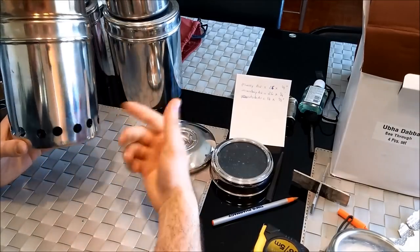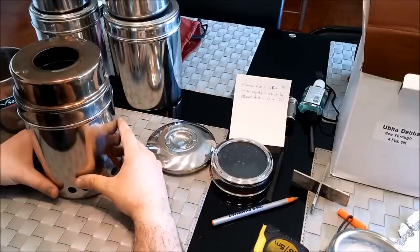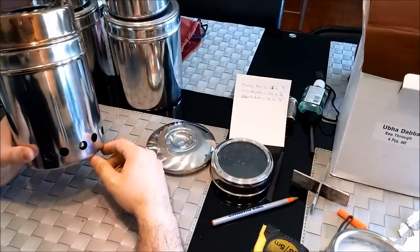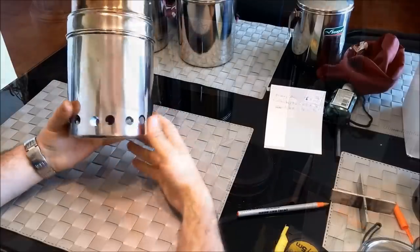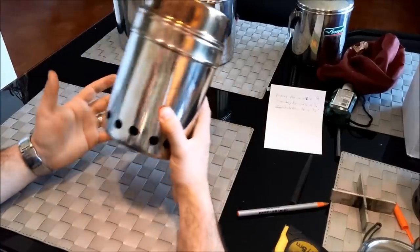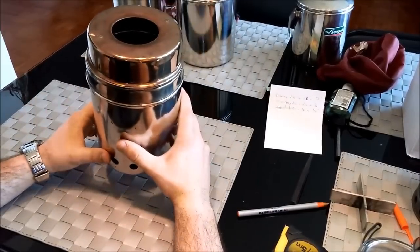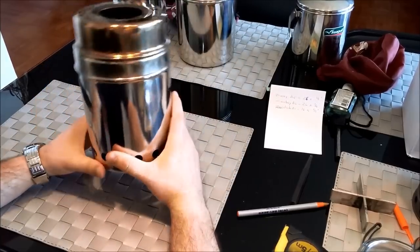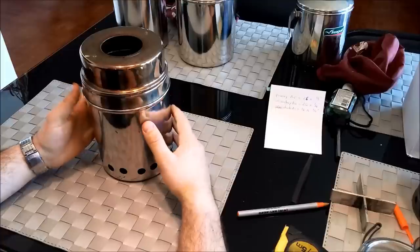It's really not easy. It's not just simply putting a bunch of holes in a couple of tins and having something that burns cleanly. As you will probably find out when you start building this yourself, there is actually a lot of trial and error that goes into building something that has the proper ratio of outside air to primary air to secondary air that gives you a nice clean burn. And there it is — a 100% stainless steel wood gas stove. You can stand on it, run it over with your car — it'll probably still work. It doesn't rust. If you're going camping, you don't want something that's going to rust and you're going to have to keep building every couple of months. Certainly from that respect this is a huge success for me — a 100% stainless steel wood gas stove.